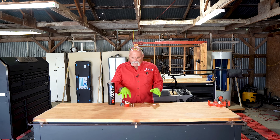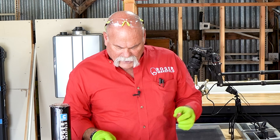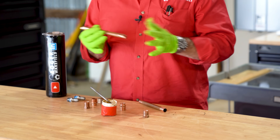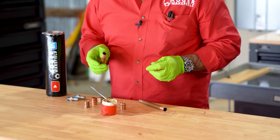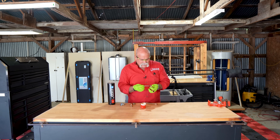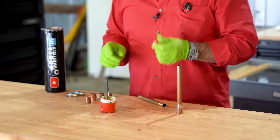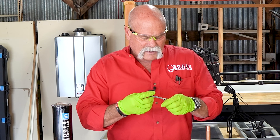Now since we're starting off soldering, we will use flux. I've got fittings that are already cleaned and my pipe's already clean. When you're soldering, clean the inside of your fitting and clean the outside of your pipe. We're gonna put flux on it. We're putting a male adapter on one end and a female adapter on the other end.